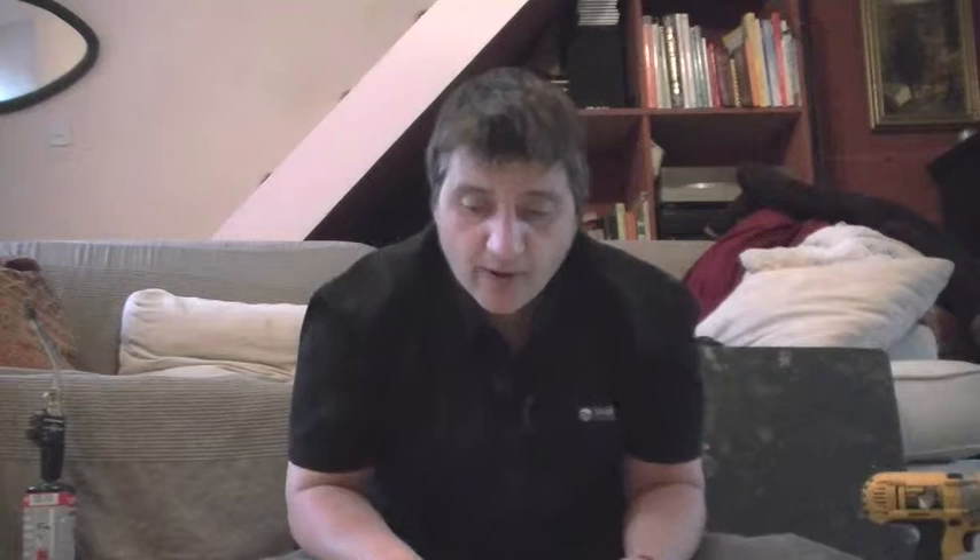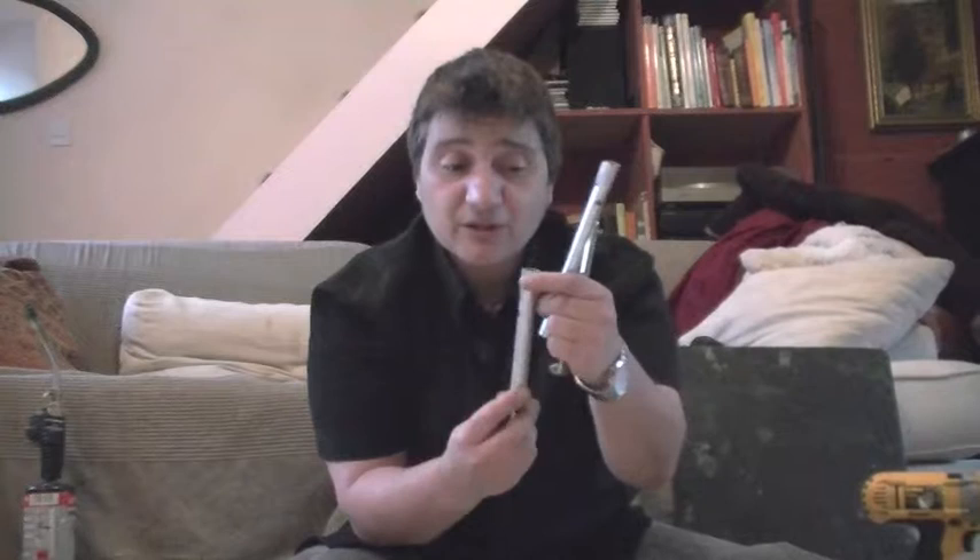I always carry a variety of box spanners. These are particularly good for monoblock taps, sink taps, and basin taps where you can't really get in with a standard spanner. I've got three of those. Every plumber's toolbox must also have a radiator spanner — this has the square end, the hexagonal end, and even the slotted bit at the end.